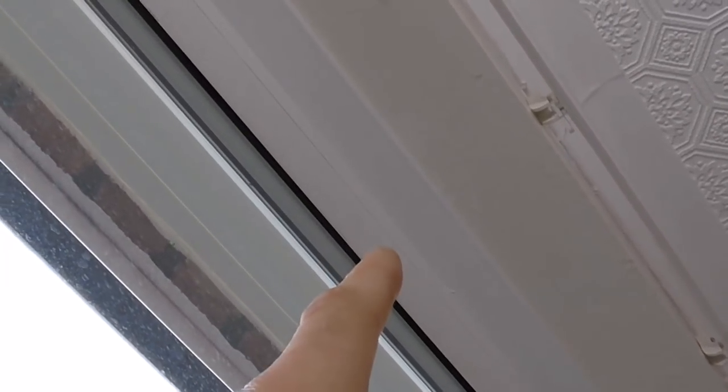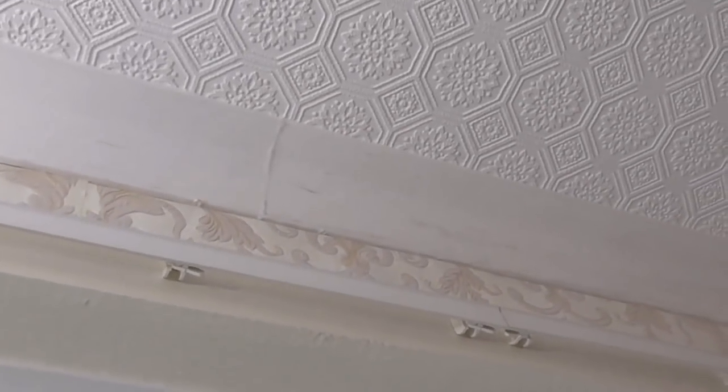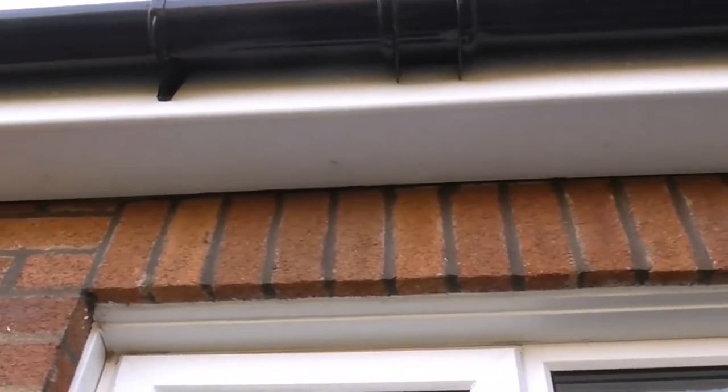And then we've got the double glazed units. This is the frame. And then outside, the plastic trim, steel lintel, and then the brickwork facing up. So then we have the soffit board and the gutter. So where that soffit board is, the brickwork won't be far past the top of that. The roof line comes to the gutter there. Well, this is the same window from outside.